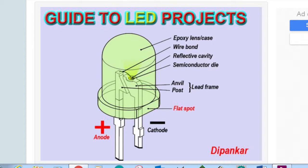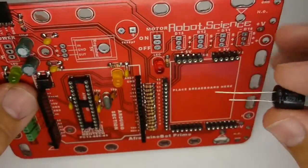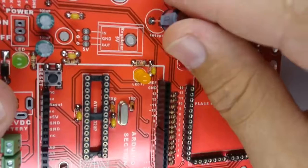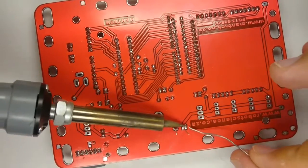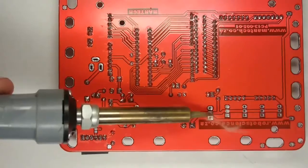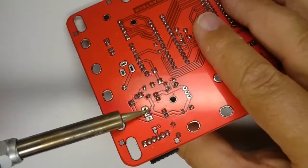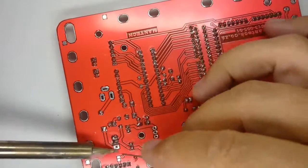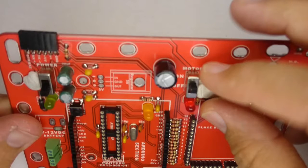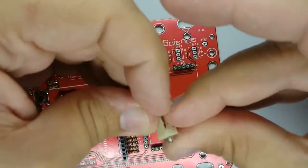Find the location for the 1000 microfarad electrolytic capacitor — the longer lead must go into the hole marked with the plus sign. Electrolytic capacitors are also usually marked with a stripe down the side, which corresponds to the negative pin, which is the short pin. Now you can fit the power and motor slider switches. If you have switches with pins bent over at 90 degrees, carefully bend them straight. Solder the middle pin first, then check that the part is properly flush on the board. Only once you're sure it's in its proper place, solder the two outer pins to complete mounting.